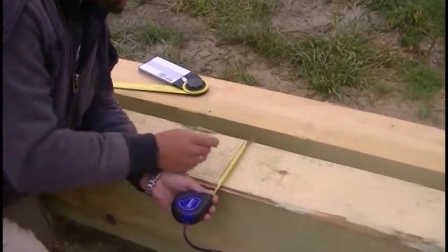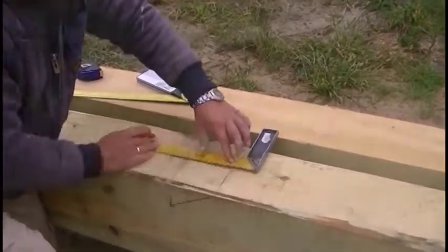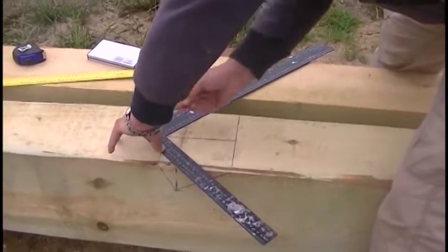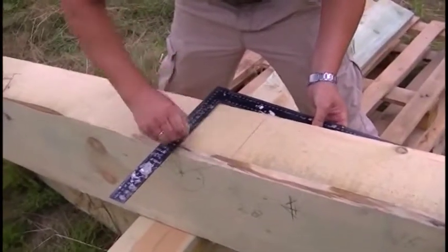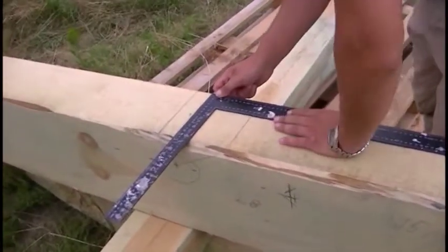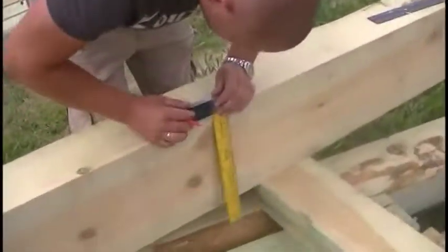The main truss is made of 4 rafters, each about 10m long, with 2 collar beams which combine with each other on the cross and are assembled precisely into these 4 rafters. At the top of the collar beams will rest 4 huge purlins, and the whole construction is going to be suspended from a so-called hanger. This is a design that has no posts, so the roof maintains its structure itself and is based only on the wall plates. It is one of the most complex roof structures in single family housing.